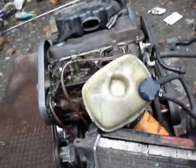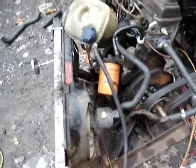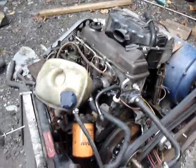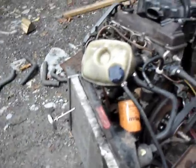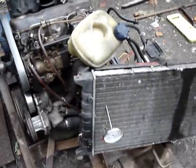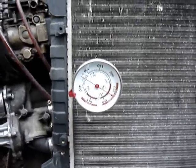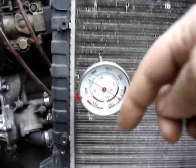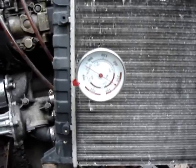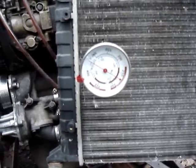The cooling system I just got sort of cobbled together right now, just to make sure everything's okay. The engine's rebuilt but it never really had an extended run. I was running it yesterday and it seems to be all right. That's a regular meat thermometer — you just jam it right through the webbing of the radiator, and that gives you a decent reading of your temperature.